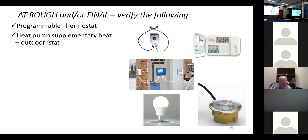And they had 72 300-foot deep loops in the ground. So 72 holes drilled 300 feet deep, and then you fed a pipe loop down into each one. You buy the loops manufactured with the 90 on the bottom, and you drop 72 of those 300 feet in the ground. And then there's your ground source. So you dump heat into it or you pull heat out of it.